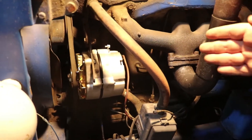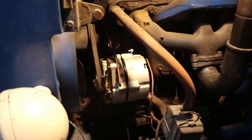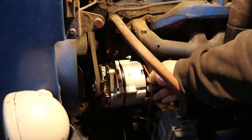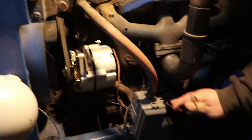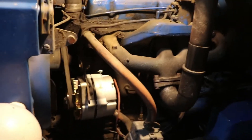Now we've got this new one-wire alternator from Jegs — they sponsored the video. This is a great alternator because it charges at low RPMs, which is great for old tractors. It is single wire, so super easy. It's got a built-in voltage regulator, so you don't need all these fancy extra wires and a separate voltage regulator. You get a system that is simple and reliable. As you've seen on my Fluke meter, 14.5 volts — I just started the tractor.